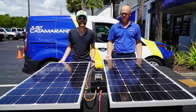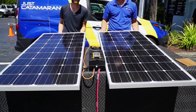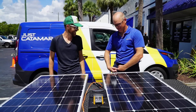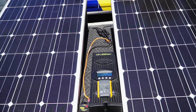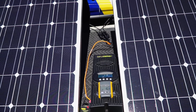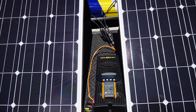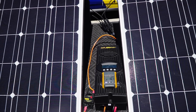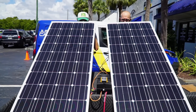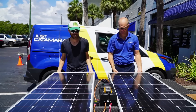We're going to tilt the panels to bring in the maximum amount of sun — we won't have this option on the boat, but we did on the RV. As we raise them, readings climb: 15, 16.1, 16.2, 16.3. That seems to be a sweet spot right there. So tilting the panels increased our output by some percentage. We won't do that math in our heads.